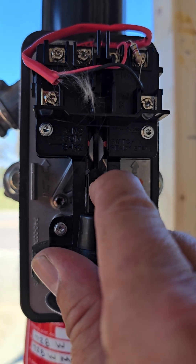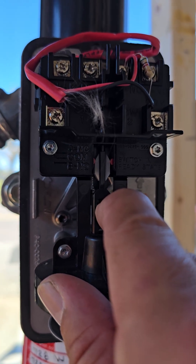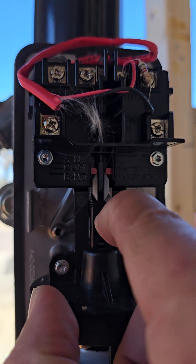I have a timer set on it for 45 seconds, because they want water to be flowing for 45 seconds before it activates. This prevents any type of false alarms — for example, city pressure changing, or pump stations kicking on.